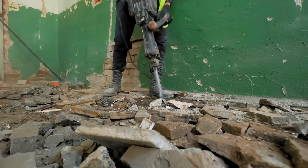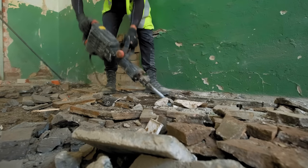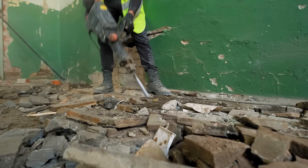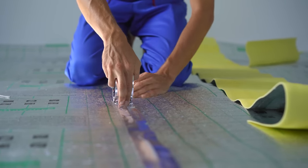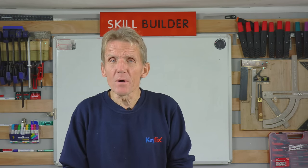The other question we get asked quite a lot is: do I need to dig up my floor — talking about ground floor here — and put insulation under the floor in order to have underfloor heating? A lot of people love the idea of underfloor heating, especially in the kitchen, but they're thinking: I do not want the disruption of digging up all that concrete just to put down some insulation and then the pipe on top. If you don't do that, you're going to lose heat from the underfloor heating pipes straight through that concrete — quite considerable. You're creating a thermal mass, and you could argue you're warming the concrete up — it's going to be a waste of heat, a more expensive system to run.